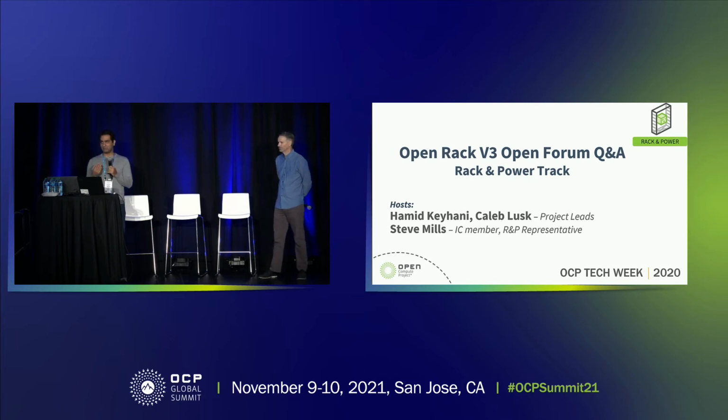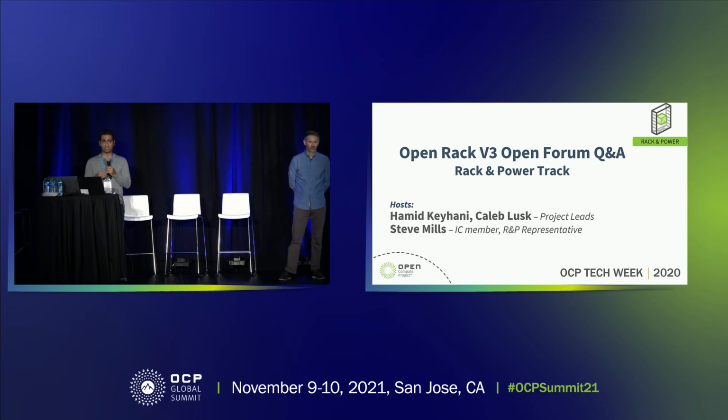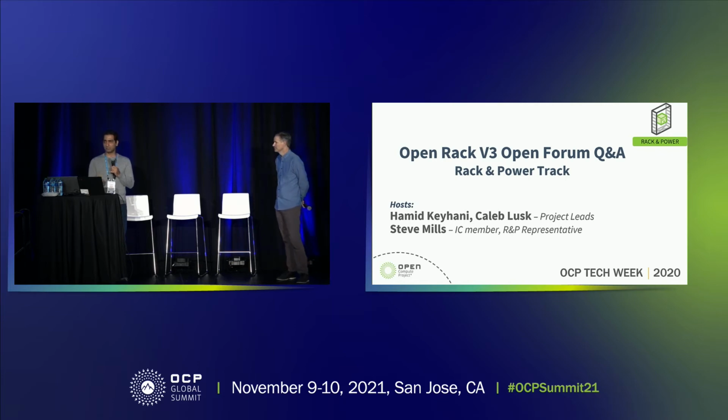The one we discussed with different communities, and the customers that had an immediate need, was Modbus. That was the one we developed, the PMI version. So there is a spec around that, and people can purchase and use that. For the other versions of communication, such as PMBus or Ethernet or other things, we have not developed any spec. There hasn't been any customer or end user that has shown interest yet in those. I've seen different suppliers doing this, but I haven't seen a customer driving those requirements. So we are waiting for that. This is open, and this is perfect for OCP. Even someone may like the CAN bus.